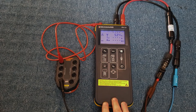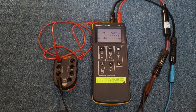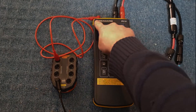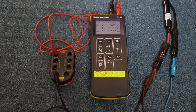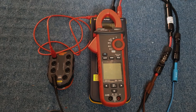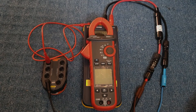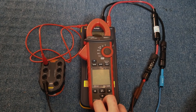Seaward will tell you that this will also measure the DC power of a string or array, measuring various voltages and that sort of thing. In practice I don't use it for any of that because it's a massive faff — you can connect a current clamp into here and voltage probes into there, but it's much easier to just use a regular clamp meter. The reason it's important to measure power and not just current is it's very useful to know whether you are importing or exporting, and if you can measure power and power factor, then you know.